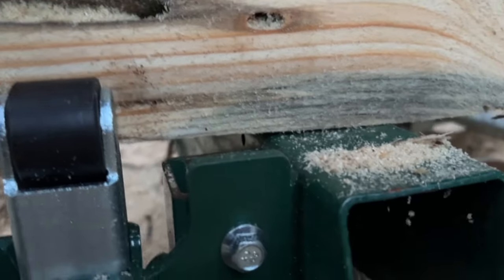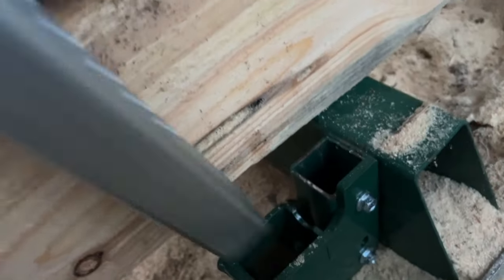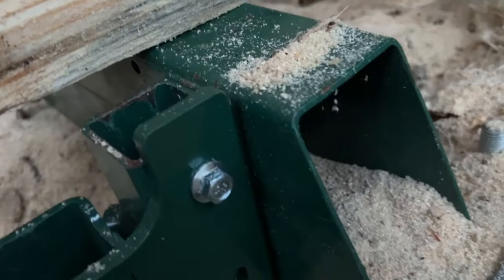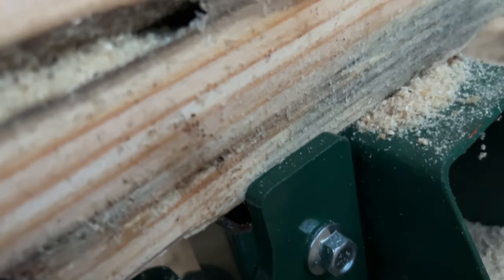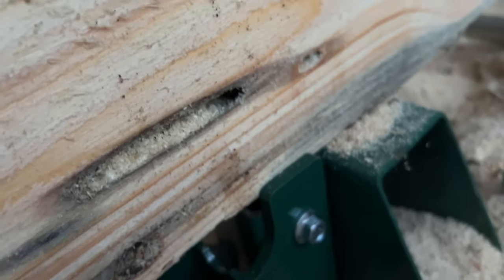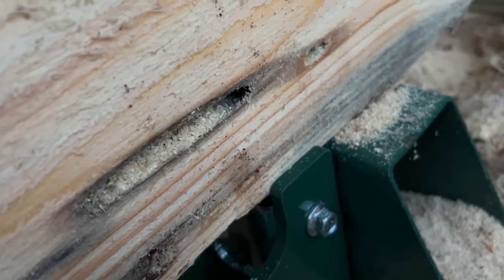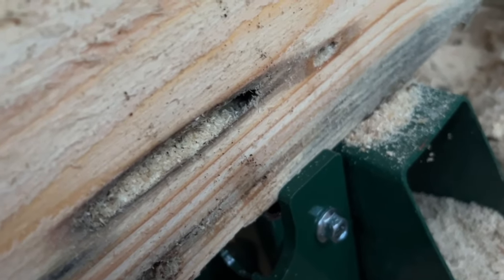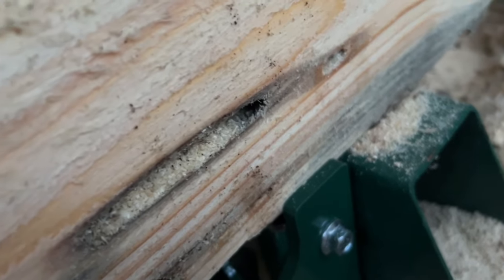However, I have discovered something that makes this not so bad. If you pull this out, push the log back, and take this all the way out — they've left you this little tab. It looks like that will let you cut a one-inch board for sure. So maybe for the final cuts you pull the pins all the way out. If you're cutting two-by-fours you can leave the stops in, but if you're cutting one-inch planks you'll probably have to take them off for at least the final cut.